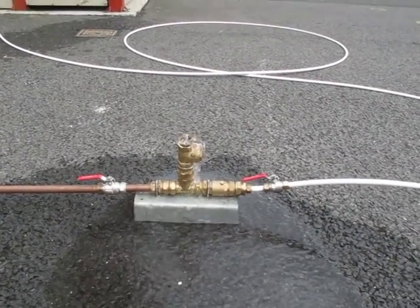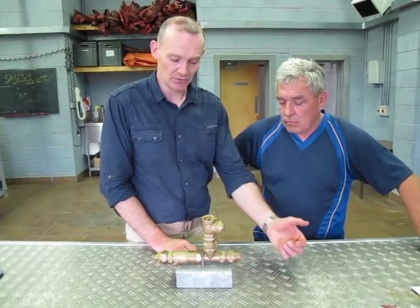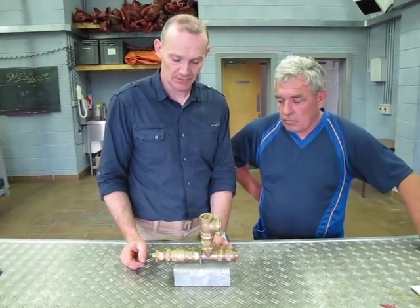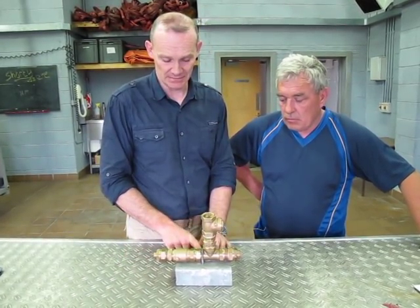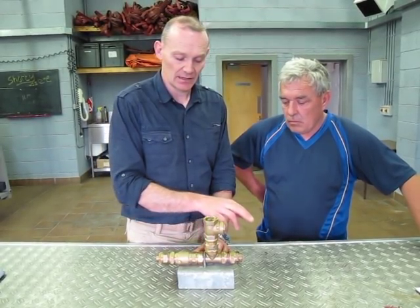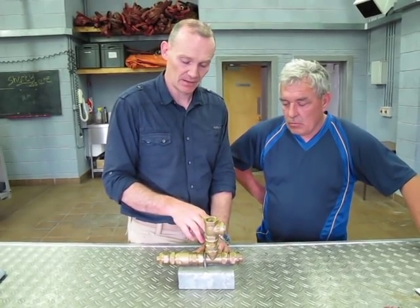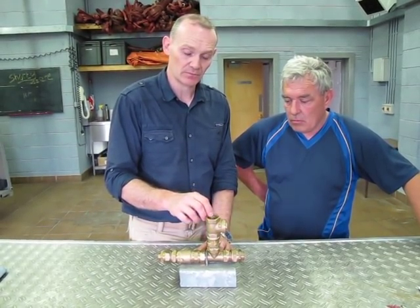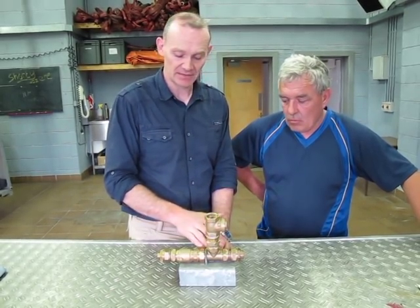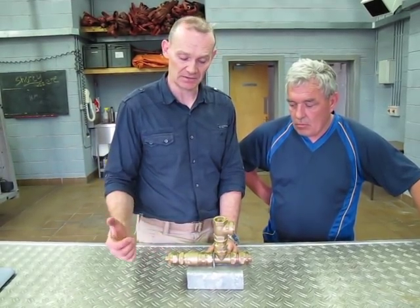The cycle begins again. A couple of other details about the pump: generally speaking your inlet pipe is one size bigger than your outlet pipe. The main reason is that in order to drive the pump we have to use about 88 to 90 percent of the water coming down through here, which means it comes out through the flap non-return valve. The other 10 to 12 percent of water goes through the discharge line and up into the tanks.